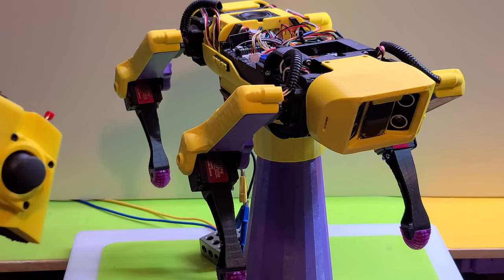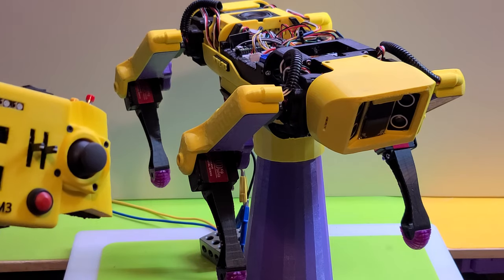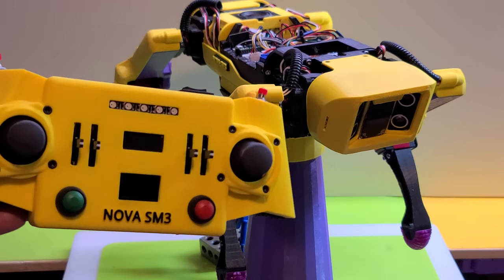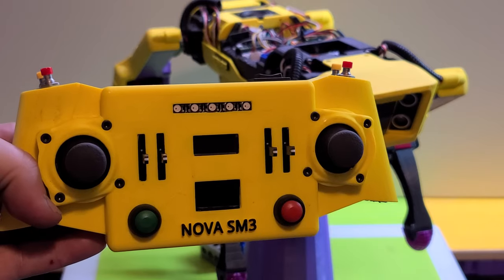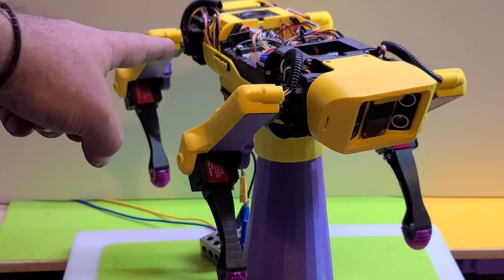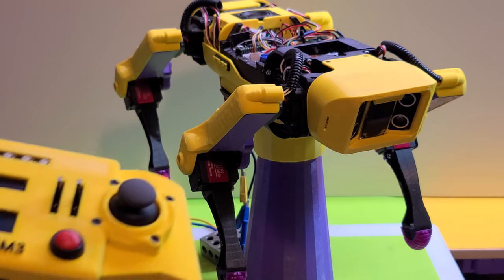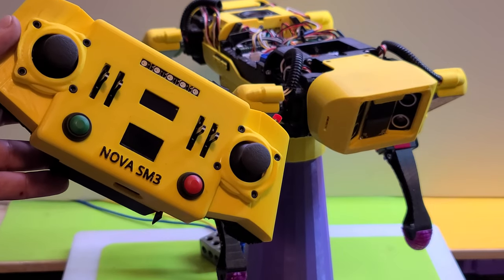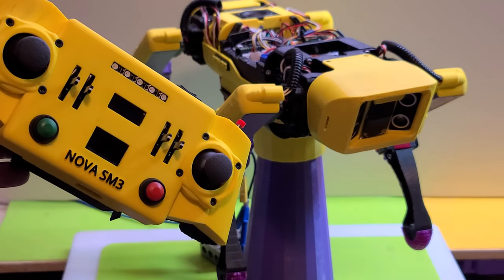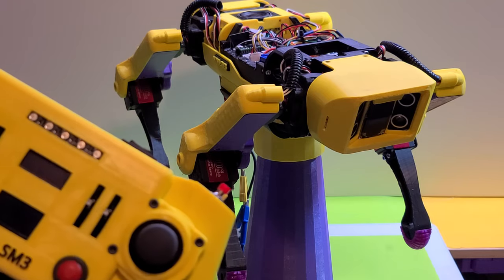Hello again. Nova's hood is off because we have one little glitch that was found by Eric Ninja over on the Discord server — much appreciation goes out to him for that. It turns out to be the same issue we had with the remote not too long ago: me miswiring the voltage regulator. It really only applies to people using the PCB, and it's a fairly easy fix that shouldn't have caused any damage. Worst case, you weren't getting feedback on your battery draining and may have drained a LiPo, but nobody complained to me about that.